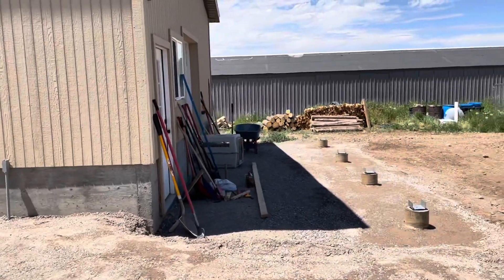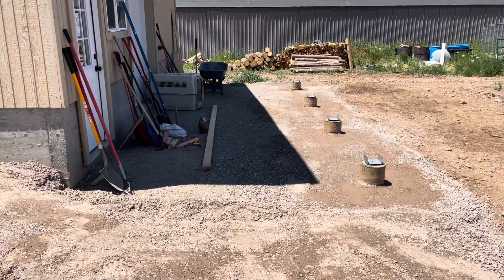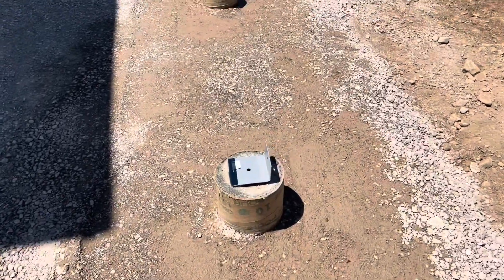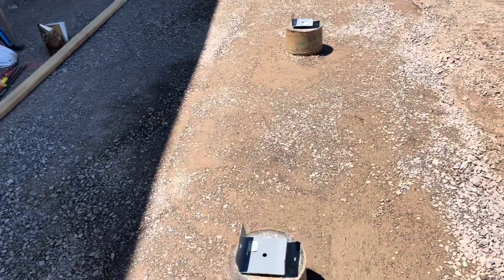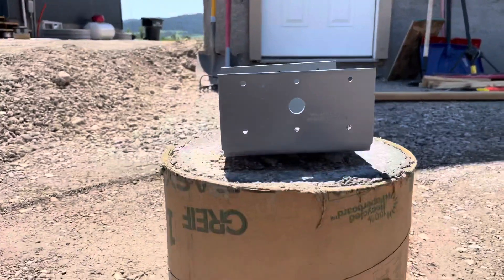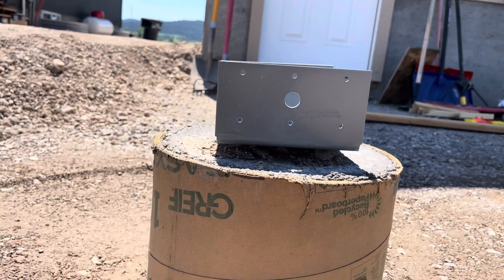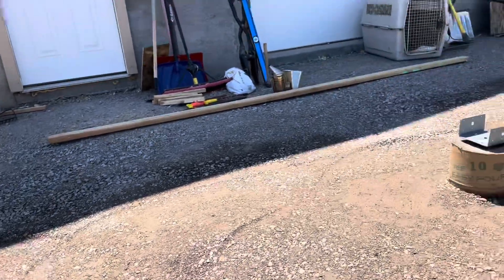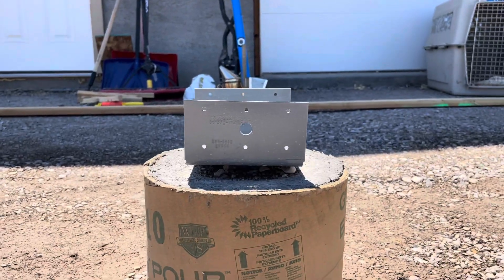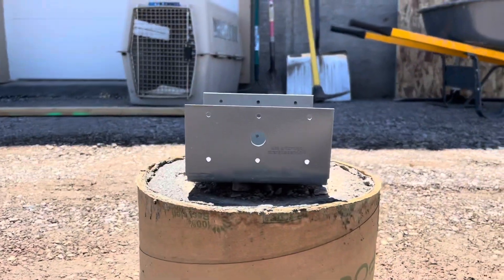I'm adding covering on both sides of the shop to extend its usefulness. One thing I noticed: I had these dead on the string line and all leveled, but with the single-post bracket style, one tipped slightly to the left — it slowly settled while I was in the house. Another one settled back and to the right slightly, and this one settled significantly back and to the left.